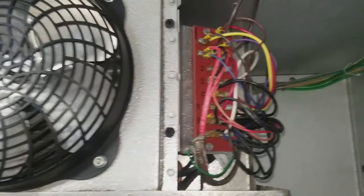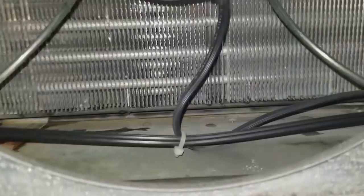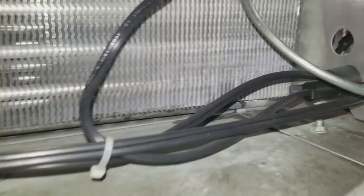That doesn't mean there isn't a short somewhere still. I opened up everything. That solenoid harness right there is not being used. I went over and checked each terminal to ground to make sure I had no continuity — I don't. Now I'm going to open up the evaporator coils and inspect the wiring. I already noticed something I don't like. We'll repair that, but I'll go through, inspect everything, spin all the motors, and if I can't find anything obvious I'll put fuses in and turn the unit back on to see if I can simulate what happened — whether or not it happened in defrost.